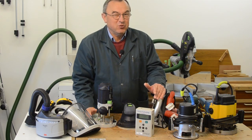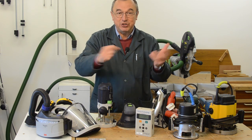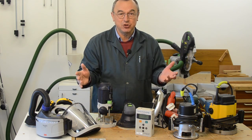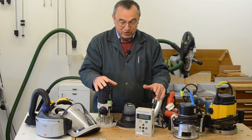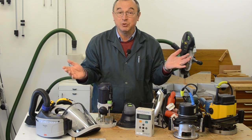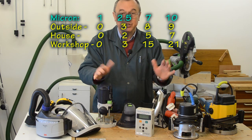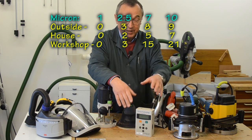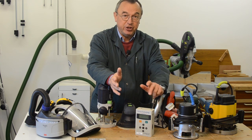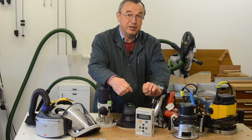The way I went about this is really quite simple. I started by having a really thorough clean of the workshop — I used one of those brushes on the end of a vacuum cleaner nozzle and did all my bits of wood, cupboard tops, the floor, the tops of my machines, everywhere where I thought there might be some dust. Then I took this machine outside to see what the dust levels were on a normal day, took it into my house to see what we live with day-to-day, and then brought it into the workshop. Starting early in the morning with no activity, I measured the background levels, then slowly progressed and used various machines both with and without vacuums attached. Some of the results were actually quite astonishing.